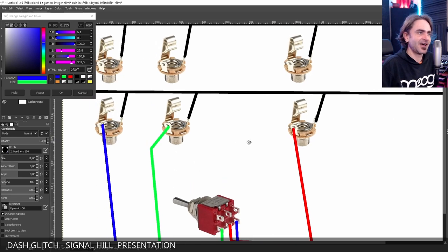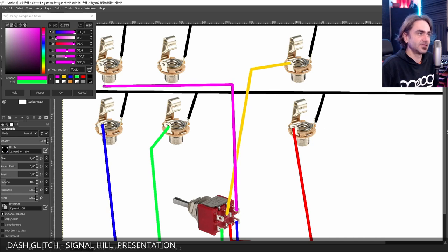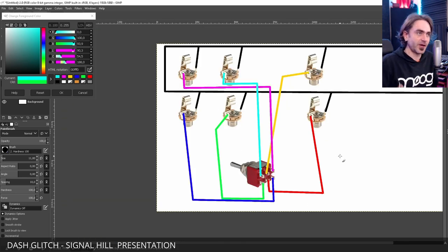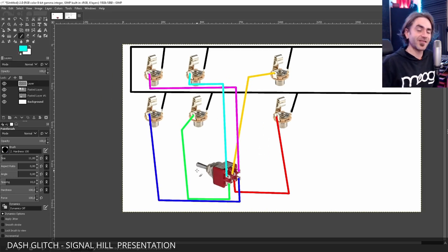So let's connect our kick triggers. Remember, the output is in the middle. Let's connect that there. So again, remember that these are reversed. So this side, and let's go with pink. This side, we want to connect to this side, right? And then let's go with light blue here. This side, we're going to connect to this one. So remember, it's reversed. And that's as simple as that. We've created one dual switch. And this is going to switch between our kick channels and the roll and the bass channel and the muted bass. The single switch is actually a little bit simpler.